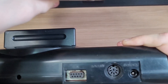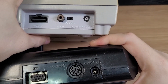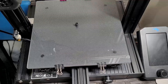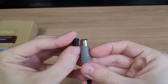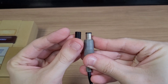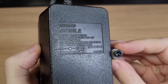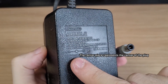The Super Nintendo AC adapter plug is a little bit different than the regular P4 plug on the Genesis, so I had to improvise a way to separate the positive and negative wires. I have a 3D printer, so I 3D printed a small cylinder with the same measurements of the original plug, and that should be enough to make sure the wires won't touch when connected. One more thing to keep in mind is that the polarity on the Super Nintendo and Genesis is reversed — you should check your AC adapter and look at the polarity icon to make sure you won't reverse the polarities.